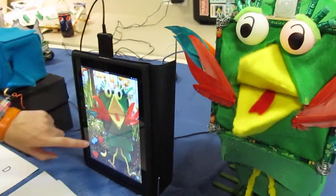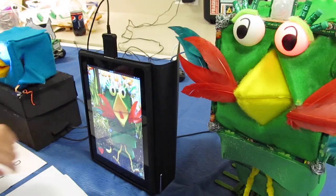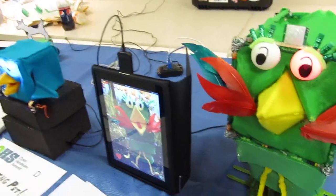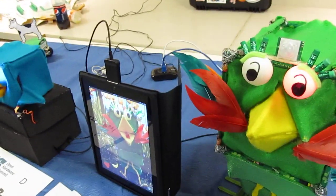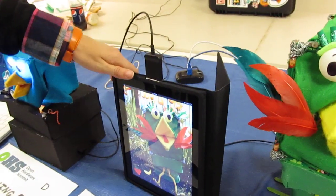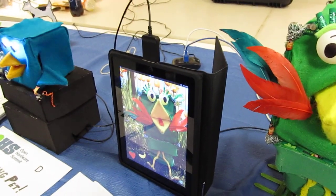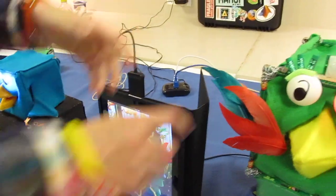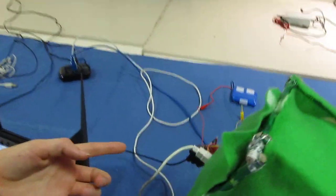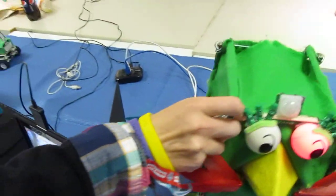And it can eat fruit forever, which is really fun. To do this, you programmed it in a different way than the other one. Right, so this one is running on an iPad. I coded an iPad app that uses the RedPark serial cable, so then it goes to RS-232, breaks out to TTL, and then goes back into the Arduino inside.